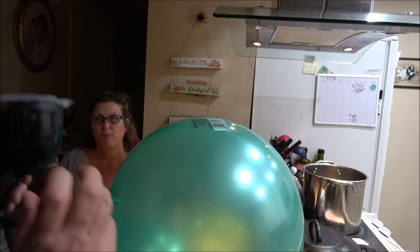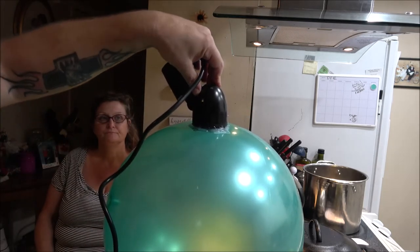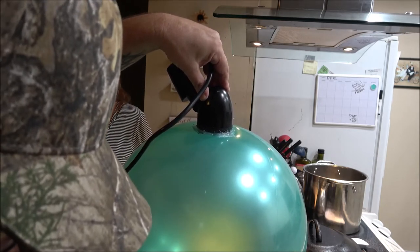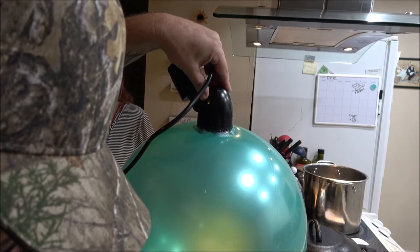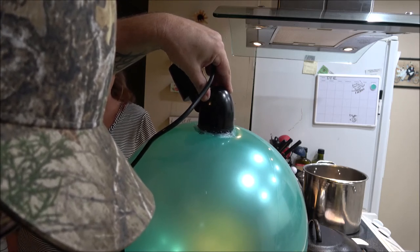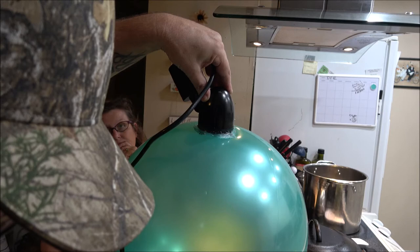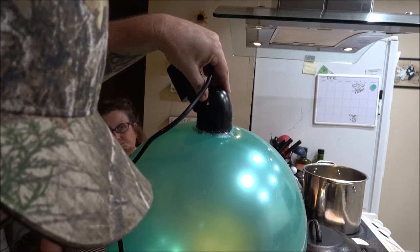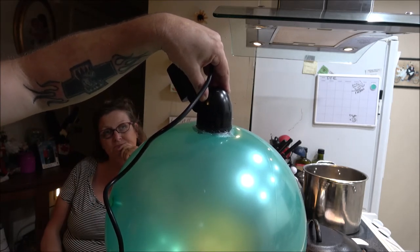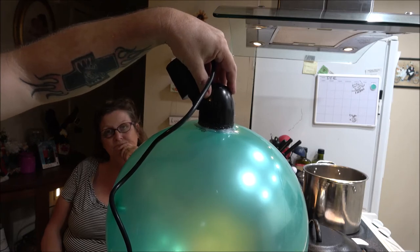It's kind of a one-time thing because once it goes back in there, it'll harden and dry and be done. We're going to put this on here just like that. It says join surfaces within four minutes of adhesive application, immediately remove excess glue with mineral spirits or rubbing alcohol, the bond sets in five to seven minutes, and achieves usable strength in 20 minutes. So I'm going to hold this for about five to seven minutes and then we'll see if that does any good. If not, I'll have to get my contact cement.